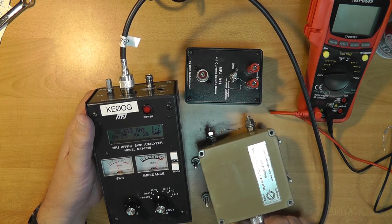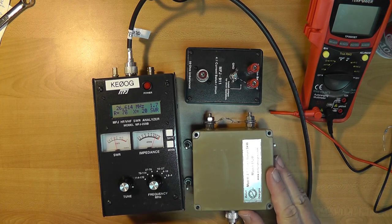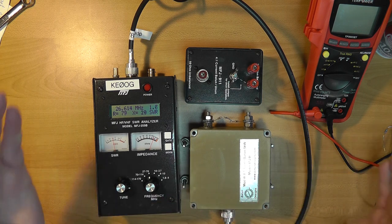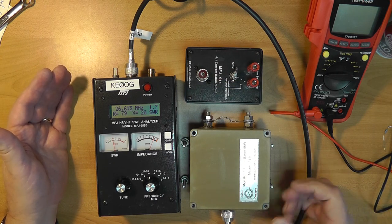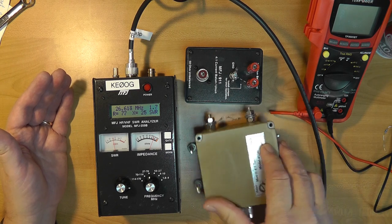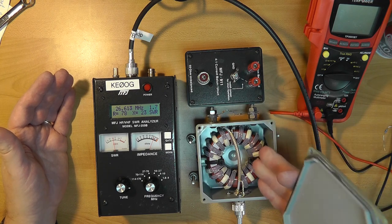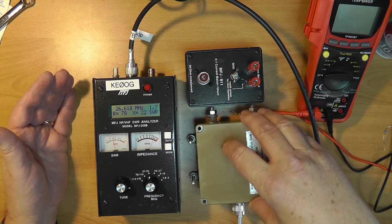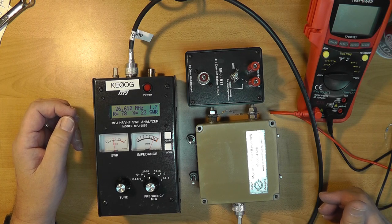So it's just what we've got — not everything is equal. I used this voltage balun for quite a long time with a big loop antenna I had. What we learned from these experiments is we actually do see the impedance being transformed from 200 to 50 ohms. The little MFJ current balun does a slightly better job, but for practical purposes they are very much the same.